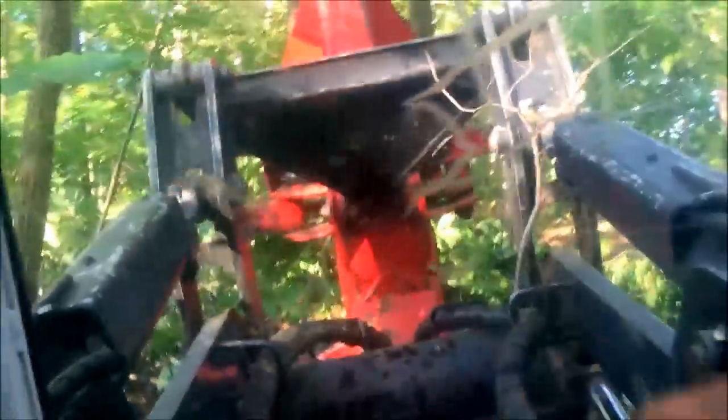In the tops, now if you go to lose one, you don't lose it in half a second. Everybody's like, clamp it, clamp it, clamp it. You ain't freaking out on the clamp pressure, because when you clamp as you're going in too much, you'll pull back and pinch your saw just like a tree sitting back on your chainsaw. You know how that feels.